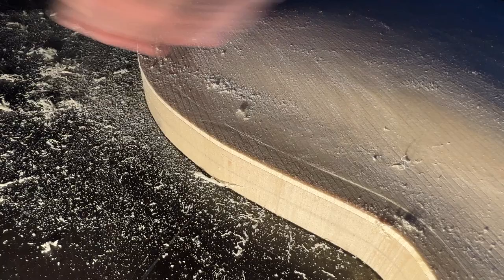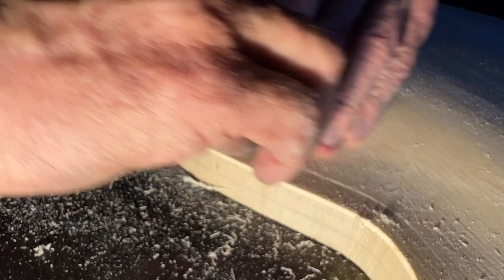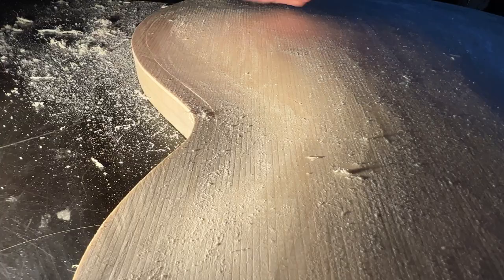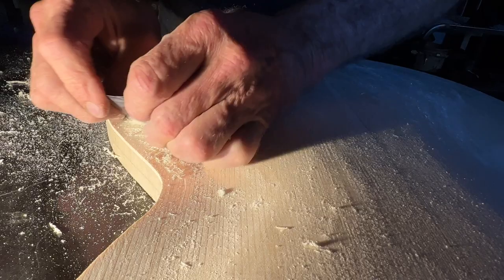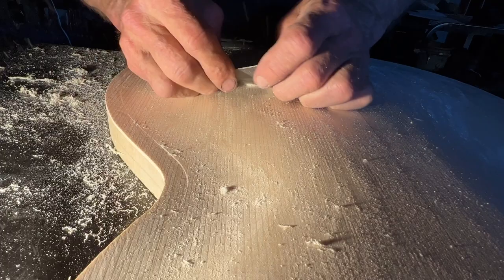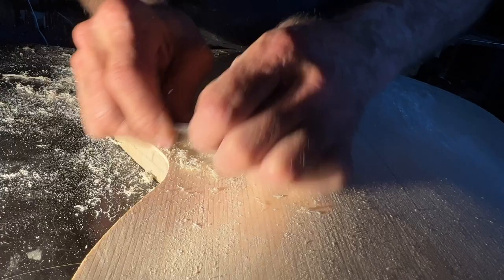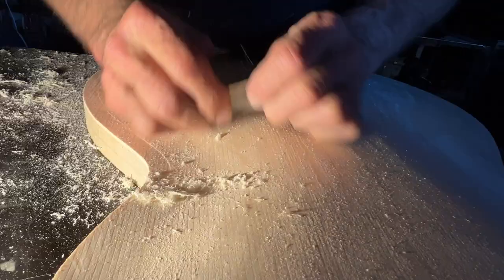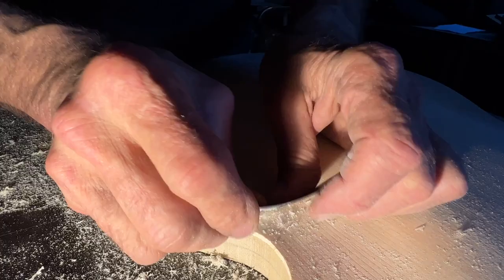You can see exactly what's happening and when you want to stop. With any woodworking really, there's a series of stages you go through in any kind of complex shaping job like this — at first you're taking off a ton of material with each stroke, and then it gets less and less as you approach the surface. I just think the scraper is great because it lets you see what you're doing without obfuscating it in a cloud of dust and scratching the wood to smithereens. You can see this little scraper is basically just erasing the tool marks and leaving a lovely surface.